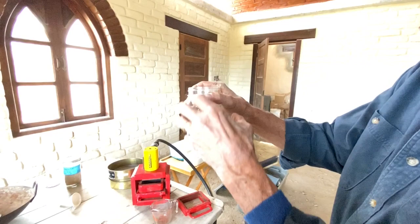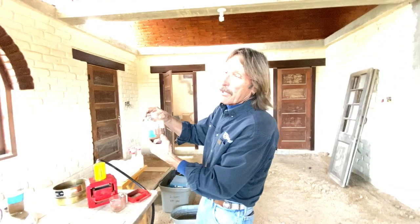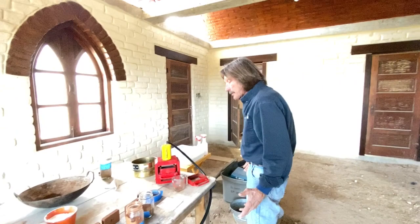Because of this piece of tape, it will also demonstrate whether your clay is highly expansive or not. When this is done, you'll see a line along the bottom because the heavier granules sink first. So you'll see the sand at the bottom and the clay and silt above it. It gives you an idea of expansiveness and a ballpark visual indication of the ratio of granules to the clay itself. That's all it does, but it tells you something - it's worth doing.